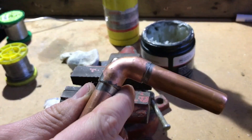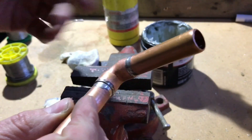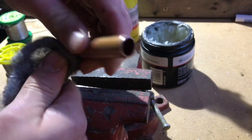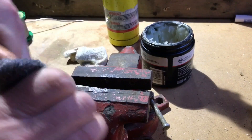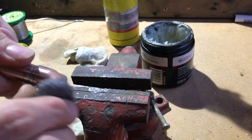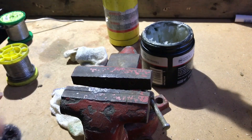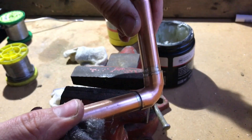So there we are — as you can see, soldered round nicely. Now don't get me wrong, you can do ring soldering and all sorts, but for a general DIY purpose this is fine. So we're going to use the wire wool just to polish up the fitting and get rid of any flux that may remain. A lot of engineers don't do this, and it really bugs me when I go round somewhere and see it, because it leaves a nasty green stain. There we are — as you can see, nice and shiny.